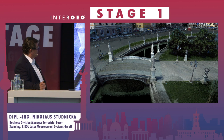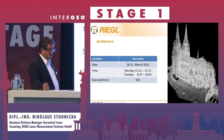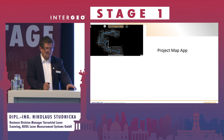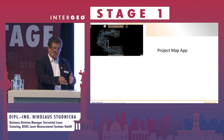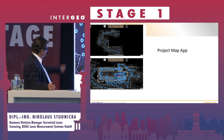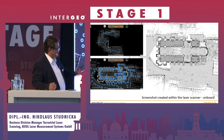Here is one example — the cathedral in Regensburg, Germany. There was a two-day scanning session: on the first day from 11 a.m. to 5 p.m., totaling 500 scan positions. It's not mandatory to have a mobile device, but you can transfer the registration information to a mobile to see all scan positions and data. At the beginning you see the scan positions in the project map, and at the end of the day you can create a top view inside the laser scanner.